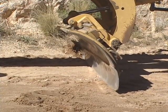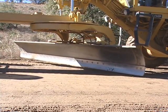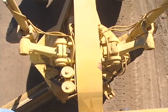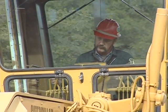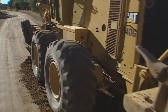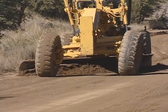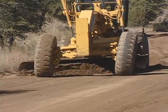Your mold board should be set in a forward position before you begin. Adjust its bottom edge according to the road's template. Angle the mold board to approximately 30 to 45 degrees from the motor grader's axis. Begin smoothing from either edge of the road. Apply enough downward pressure to the mold board to allow removal of minor surface imperfections and to release sufficient material to fill shallow potholes or ripples. Adjust the overall angle of the mold board within the 30 to 45 degree range as necessary to maintain a steady amount of material in front of the mold board as you go.